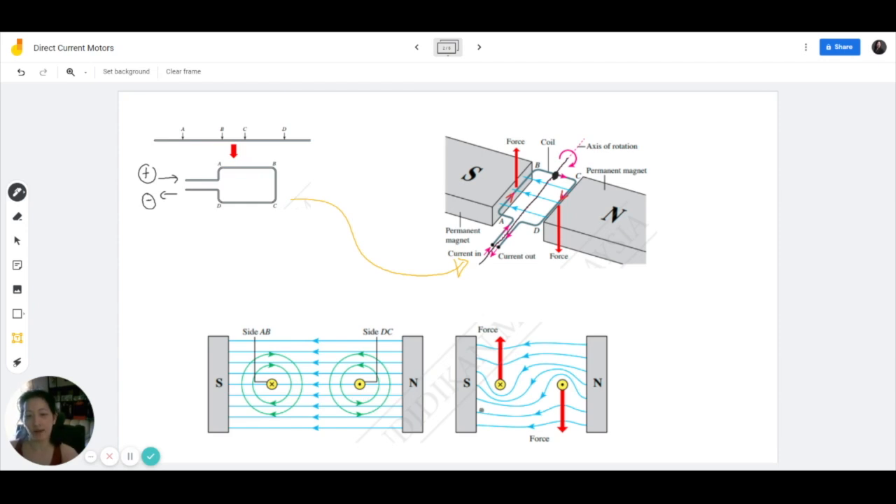What we see at the bottom here are the top views of that field. The diagram on the left shows us the original magnetic fields. The blue colored lines show us the magnetic fields that exist between the permanent magnets and the green colored circles show us the magnetic fields that exist around the cross section of those wires. The X symbol represents current flowing inwards and the dot represents current flowing outwards. The interaction between these magnetic fields will produce a catapult field, which is the diagram on the right side, and this is how it creates a pair of forces acting in the opposite direction.